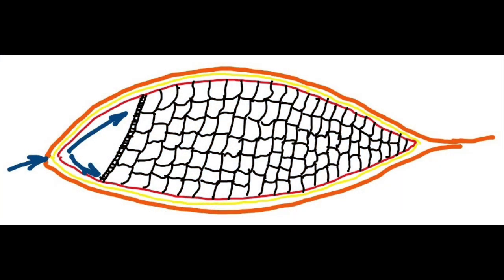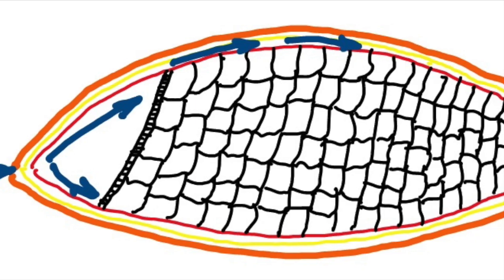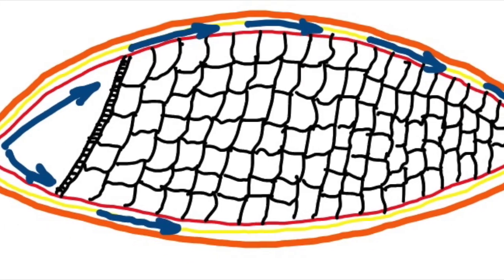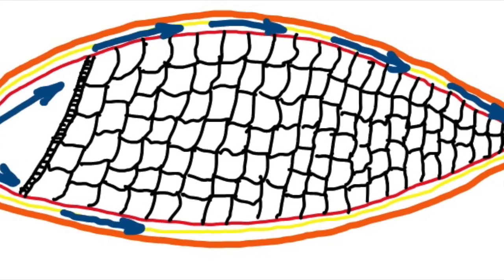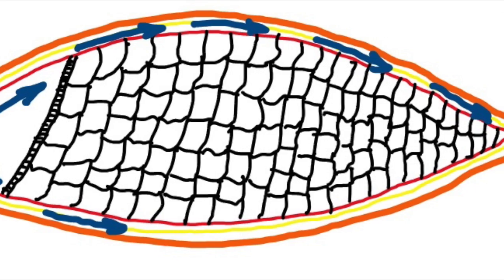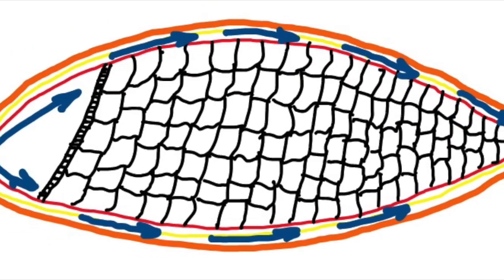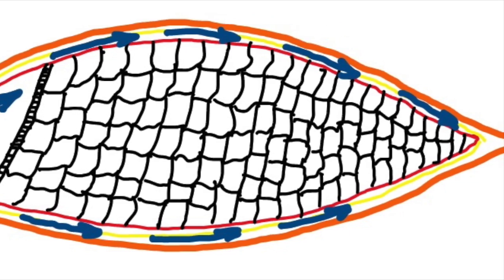When barley is soaked in water, some of it enters the seed through the micropylar region. This water then hydrates the embryo and aleurone. It moves slowly through the seed from the proximal to the distal end, but more quickly along the dorsal edge. Hydration begins at the embryo, extends through the scutellum, and reaches the aleurone layer.